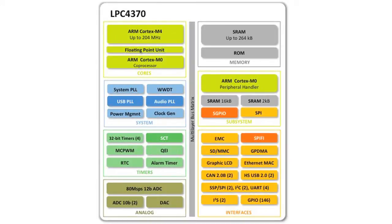I'm Gordon Cooper with NXP. I'm here to tell you about the LPC4370, one of the newest members of our 4300 series of microcontrollers. The LPC4370 is based on the ARM Cortex-M4, a 32-bit core with some digital signal processing capabilities. We have the fastest core in the industry at 204 megahertz.